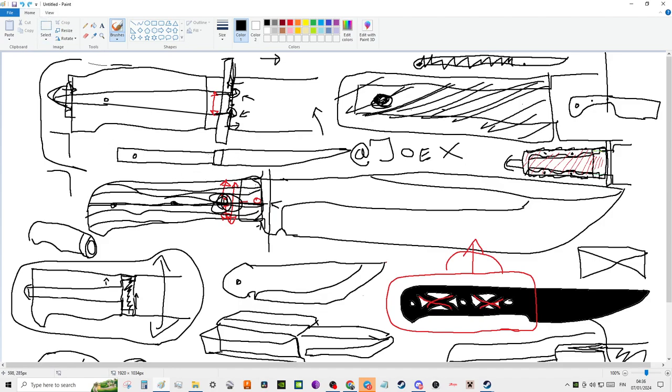Believe it or not, katanas have rings. So let's put the tsuba in just for the sake of having a tsuba. The katanas have rings at the front of the handles, just like I do with these Bowie knives and other knives. They do this, and then they do their katana wrap right over it. And the wrapping should help actually keep the wood together. But what's interesting is that they don't use metal pins; they use wood pins. And it's possible that the reason they use wood pins is because metal pins help induce cracks in the wood. They will help the wood split.